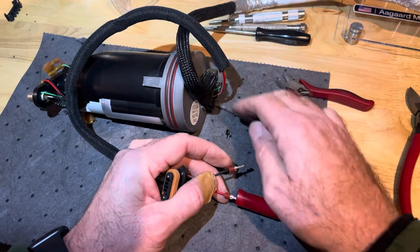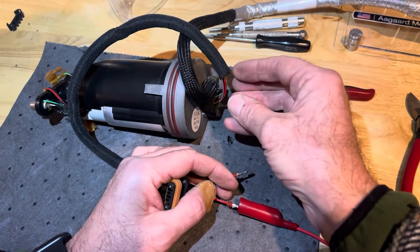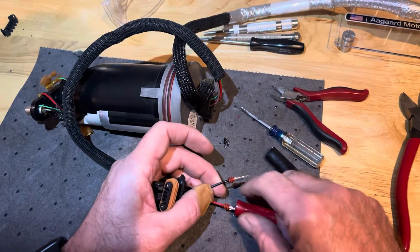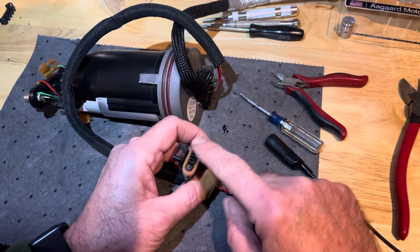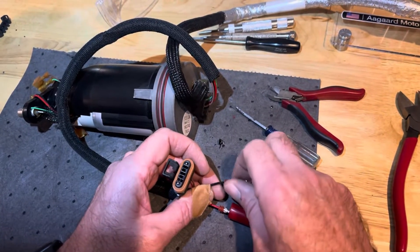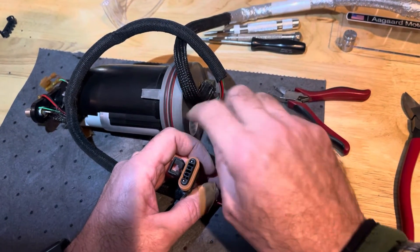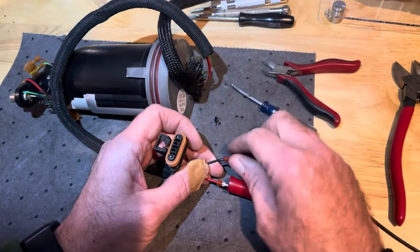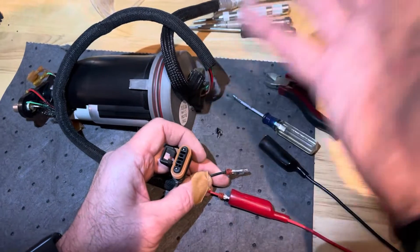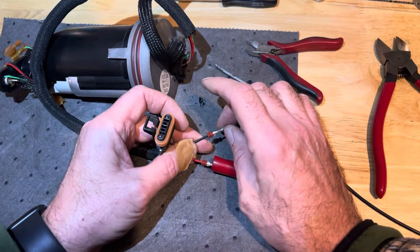What we will do is take care of the loose ends, fill that with epoxy, and then put a flyback diode in the harness itself, which we are going to make available in the web shop for people to buy. We're going to make it part of the rebuild kit for no extra charge, or you can just buy the harness if you've already done this work. It will come with a male and female connector and it's just plug and play. Thanks for watching, and we'll see you next time.